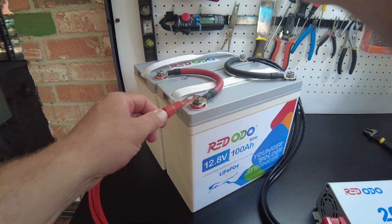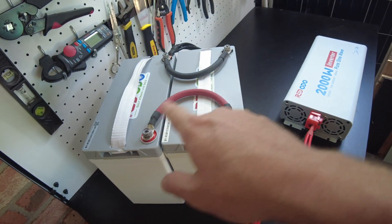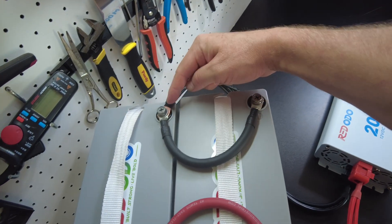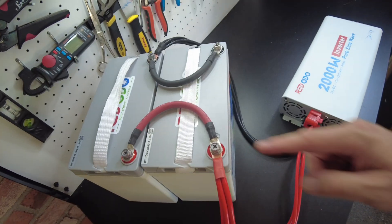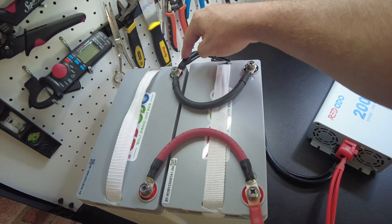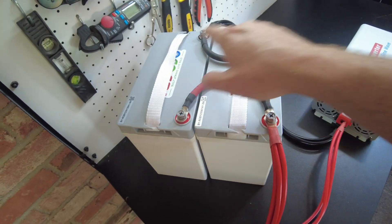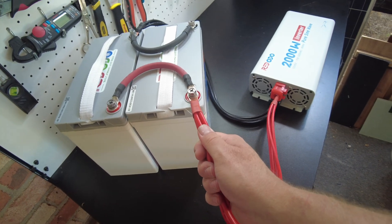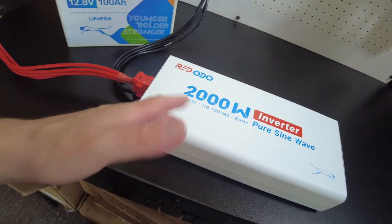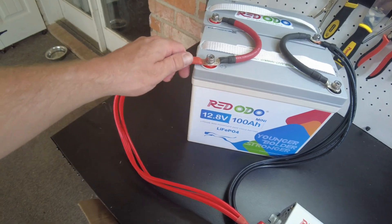We got a tiny little spark — that's fine. For anyone who doesn't know this: when paralleling batteries, I've got the positive going to the inverter on one side and the negative going to the inverter diagonally. You do this so it draws current from both batteries equally — if you had the negative and positive going to the inverter on the same battery, it would draw more current from that battery and less from the other, causing an imbalance. Also, whenever you do this type of installation it's a good idea to fuse it. It is fused internally and the BMSs have short circuit protection, but for an actual install, go ahead and add an external fuse.